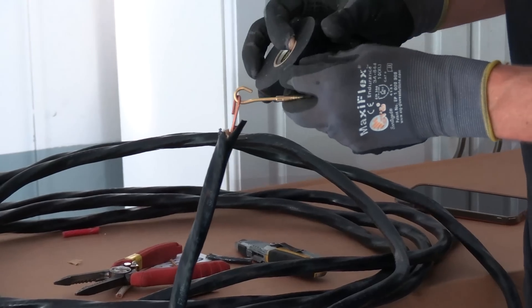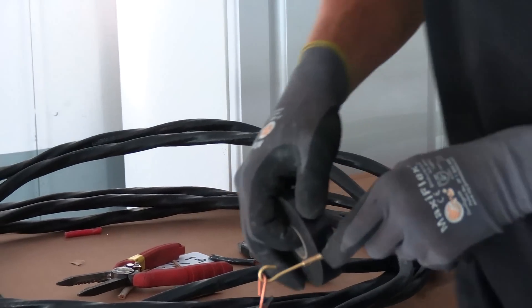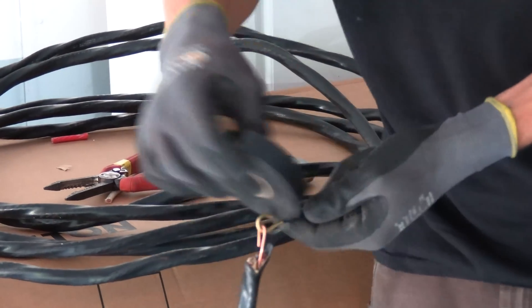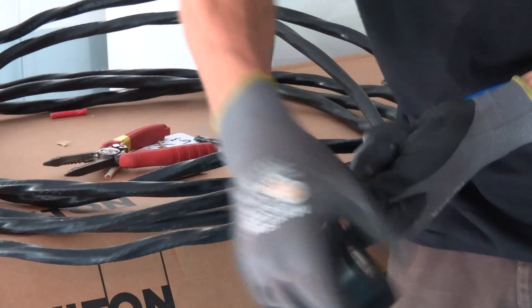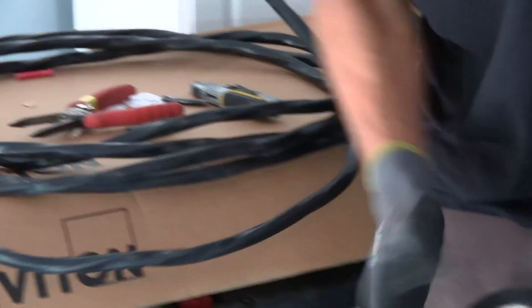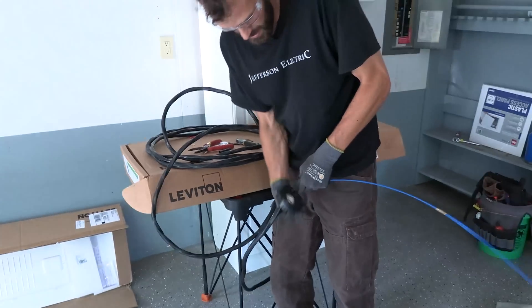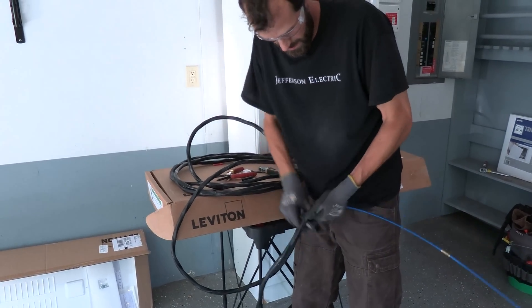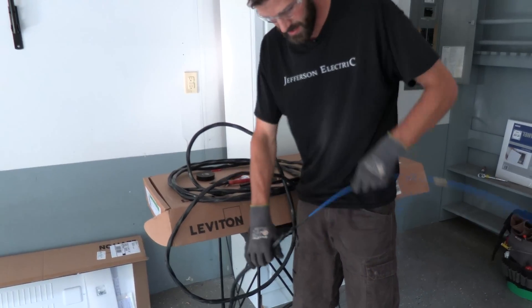Always put electrical tape on the connection — not duct tape, painters tape, scotch tape, or masking tape, but electrician's tape. It has elasticity which allows it to be pulled tightly for a much better grab than any other tape. If you're going to do this project, spend the dollar at the home center and get Scotch 33 or 88 — you'll thank yourself. Now smooth that edge to facilitate the wire pull.